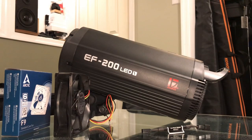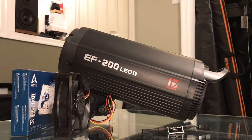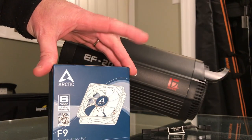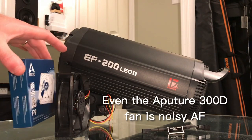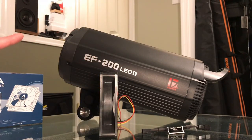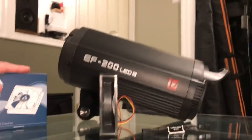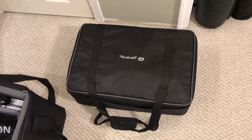I hope this video has been helpful. I don't want to open this light again because I suffered fighting with it for 15 days. Three screws here and three screws inside — that's all it takes to open it. You're still going to hear some noise from this fan because you cannot use a silent fan — the RPM would be too slow for a light of this power. But it's about 35 to 40 percent quieter, which I measured in decibels. Do not go below 1800 RPM, and use a reputable brand like Arctic — that's the perfect fan for this.